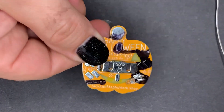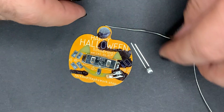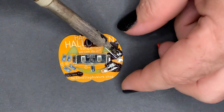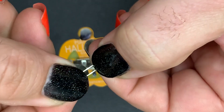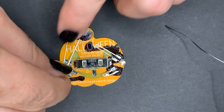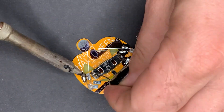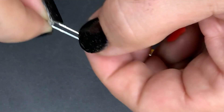If you didn't get it on your first try, you most probably have your LED backwards — the long leg goes inside towards the battery. I did this on purpose to make sure that if you get a little extra solder blob and it touches some other pad, it really shouldn't be a big deal. We'll go through the remaining LEDs pretty fast because it's all the same — if you've done one, you've done them all. At this point we're like 75% of the way done with the project. Congratulations.